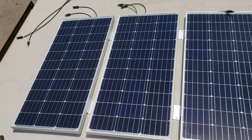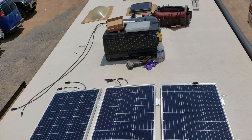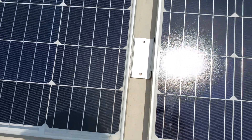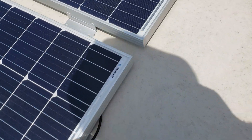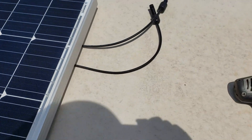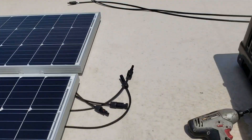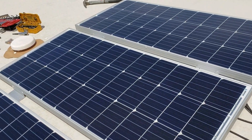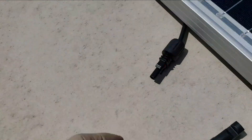That's basically what it's going to look like. I've left enough space up there so you can service the AC without running into the solar panels. You can see how I'm overlapping — I have the middle ones on top, kind of like a shingle. The wires from each panel generally meet in the middle, and that's where I'll connect them to those roof wires. Let's get these things secured — I like to secure at least one end so they don't move on me. I'll throw some screws in and then wire this thing up.